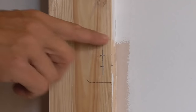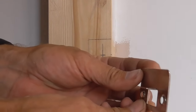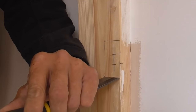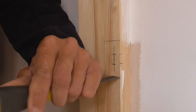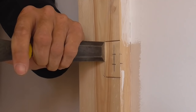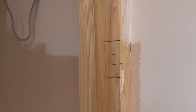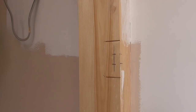What I'm going to do is put my chisel around the outside edge of this, set it back a little bit, and then I'll take the rest out with a router because this is quite a thin plate and if you chisel it, it can tend to make a mess. But I understand not everyone has a router — if that's the case you just have to take your time chiselling. I'll go just round the bottom and top, keeping back slightly from the marks because the chisel will drift. Actually, I'll take this out by hand — that's probably fairer because most people might not have a router.